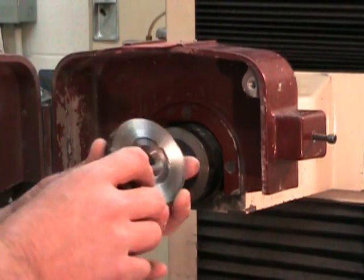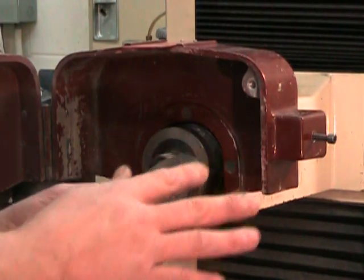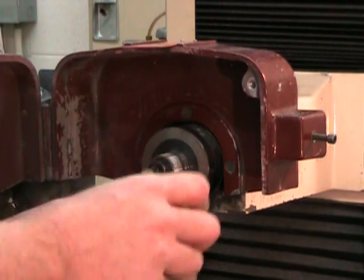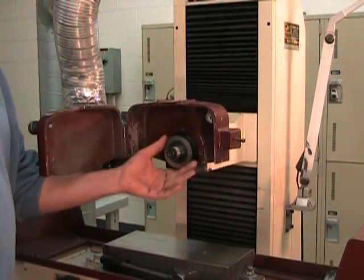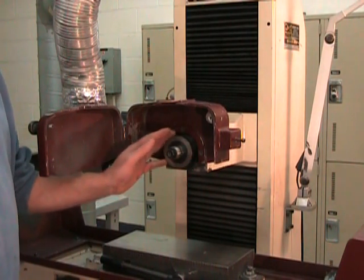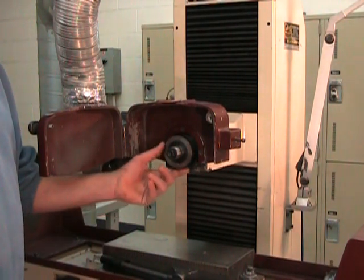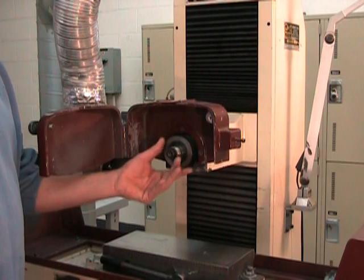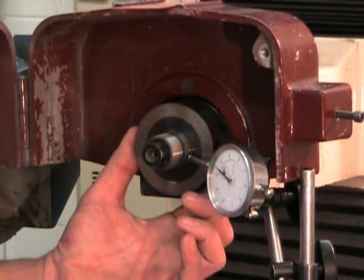I'm going to want to keep an eye out for damage. Since I've just removed this threaded flange, we're going to take a few seconds to visually inspect it. Looking at it, everything seems fine, so we can set this aside and move on. However, this second flange — the one mounted directly onto the spindle with a taper — will have to be inspected more closely. We're even going to install a dial indicator to check for run-out. We need to make sure the accident hasn't bent the spindle or cold-welded or galled the male taper to the female taper.